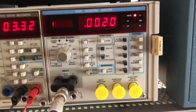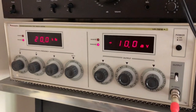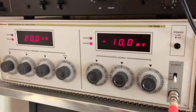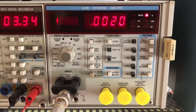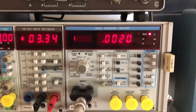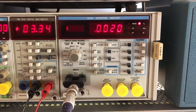One last look at the adjustment process: adjusting the phono preamp for distortion. You feed in a 20 kHz signal at minus 10 dBV and null out the distortion — minimize it, notch it out. I'm using a different procedure to the one in the service manual because that one just overloads the phono pre, whereas this feeds in a sensible signal and lets you minimize the distortion. In both channels we're now down around 0.002% distortion, which is very cool. Phono pre is adjusted, the whole amp is now adjusted, and we'll do the final finishing touches.